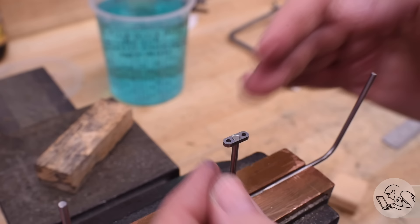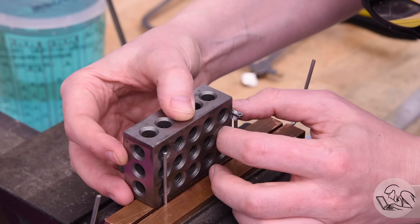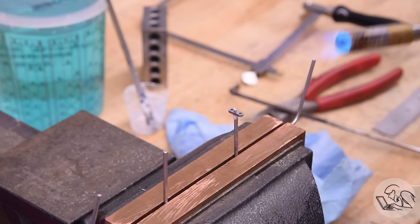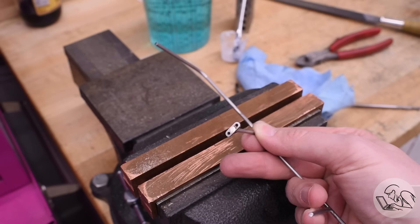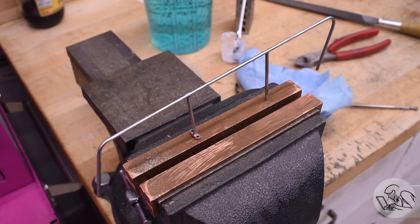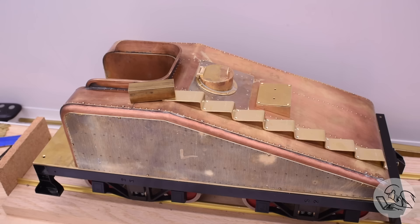On to soldering the little feet. They have a chamfer on the underside which gives the silver solder somewhere to fill in for a stronger joint. I use the edge of the vise jaw to align the feet 90 degrees to the railing. A better technique this time: I place a tiny piece of solder right on the joint before heating. As soon as the correct temperature is reached, the solder flows and you know you're done — you're not going to overheat the joint. That worked much better. A little bit of filing for excess solder on the bottom and that looks like a really nice joint. A smaller torch would help too — this is the smallest I have but it's still quite overkill. And the thing stands up on its own, so I must have done something right.